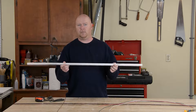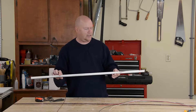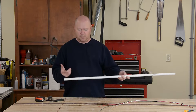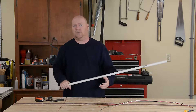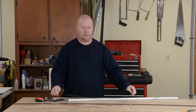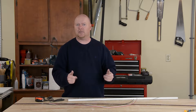The boom for my antenna is this piece of PVC pipe that I have laying around. I only really need about 36 inches or so for the antenna — this is a four foot piece — but I'm gonna leave it like this because in a real emergency situation, you might not have something to cut PVC with. I need something to make my elements out of, and that's where this comes in: a random length of 12-gauge electrical wire that I pulled out of the main sleeve, giving me four different pieces of copper I can trim to the various lengths for the elements I need.